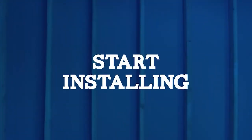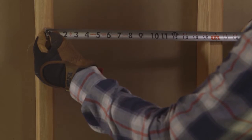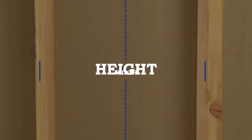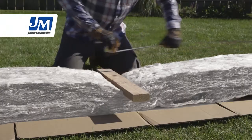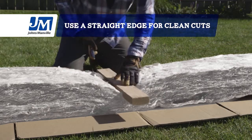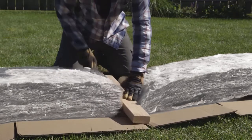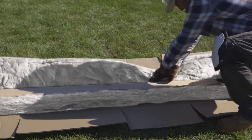Let's get down to it. Measure your wall cavity opening to make sure your insulation will fit top to bottom and side to side. If it needs a trim, cut it using a utility knife and a straight edge like a 2x4. If you're working with a space narrower than your insulation, cut it down the center for a good fit.